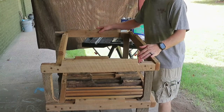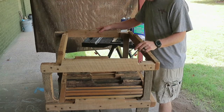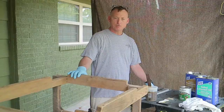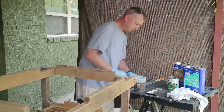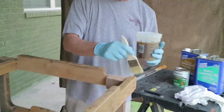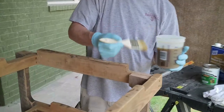Y'all notice I did not sand this. I'm not going to sand it — it's supposed to be a rough finish. I just knocked all the debris off, all the little cobwebs, stuff like that. Cleaned it up a little bit. And now I'm ready to start applying my finish. I'm going to start with the chip brush, working on flooding the underside first. That way we can flip it up right-side up once we get all this secured. So we're going to flood this and see how well it soaks in — all this end grain is probably going to soak it up.